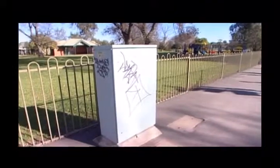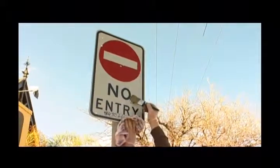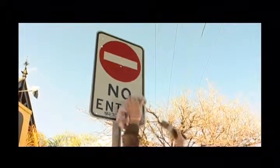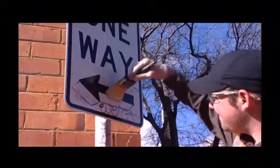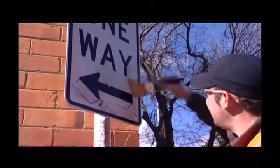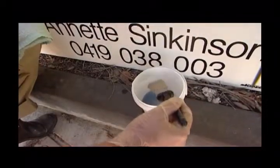If it's small graffiti, perhaps even on a painted surface, or it's on things which cannot be painted out — such as powder coated signal control cabinets, pre-painted fencing or cladding, real estate or road signs — and this graffiti positively must come off without damage to the underlying surface, then we use our sensitive surface graffiti remover. That's the one with the blue label. Simply pour a small quantity into a small plastic bucket and, using a nylon paintbrush, apply it to the graffiti and agitate as if you were writing with the brush on small areas at a time.